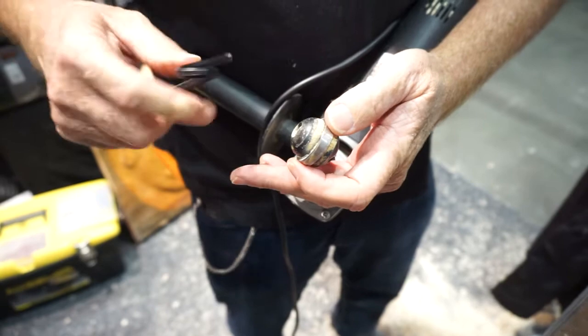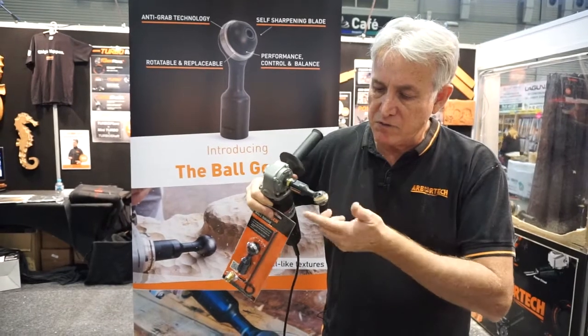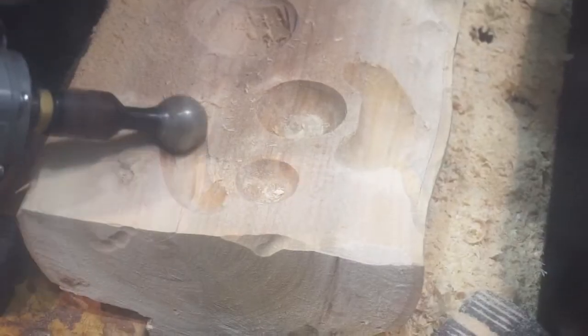There's no cutting edge on the very end because the blade is offset. But as soon as you lean it over, it'll cut doing a beautiful dimple shape. You can actually plane on the end of it and the blade will cut backwards, forwards, or sideways. It's a beautiful three-dimensional cutter.